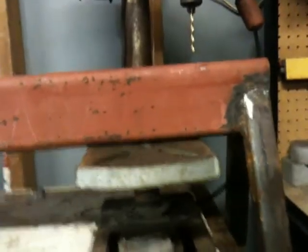There are my hole locations marked. Getting this thing to sit relatively securely and accurately in position — especially since it's got the legs welded on — involved a little bit of ingenuity. I had to swivel the head on the drill press and build a little stand so it sits level. Now I get to drill.